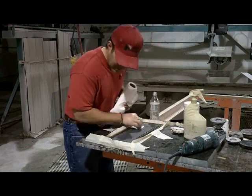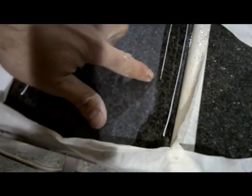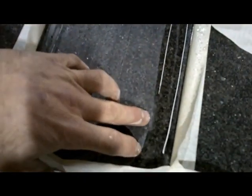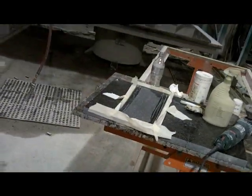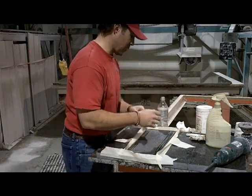The one thing I notice here — right through here there are some pretty deep scratches. Those are 200 grit scratches. Everything else looks really pretty uniform, nothing is standing out as a 200 grit scratch other than right through here. Which is why we needed to put those lines in — I kind of got a little carried away with the 200. Those lines keep you on track and make sure you don't go too far out of bounds.